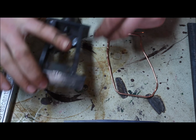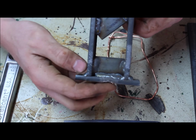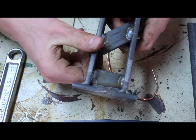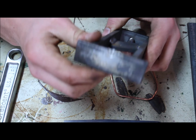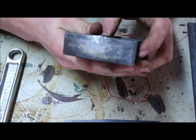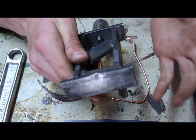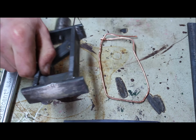Also on the top die, you'll see the contact plate that actually comes in contact with the things being crushed, like the wire for instance, has been completely warped and squished to a degree. I hope this is picking that up. If it's not, my apologies. You can see there's some pretty severe deformation right there, indicating that this plate should have been made out of probably a hardened, or definitely a harder steel, possibly thicker too, I would say.